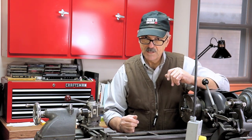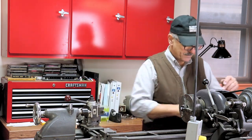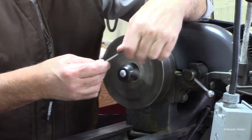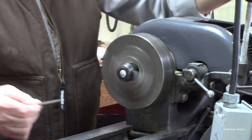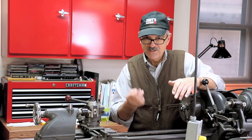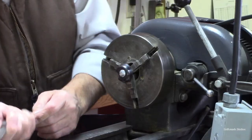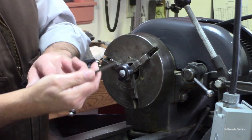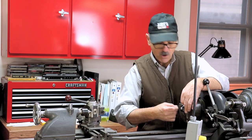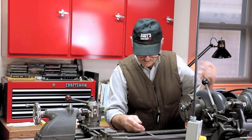There's a bunch of little pitting in it, so I'll use a small file to take that pitting out, then go over it with sandpaper and get it polished up to match the same level of polish as the rest of the gun. One caution when doing this on a lathe: you don't want a death grip on the file, because if the file is in your palm and it catches, it's going to drive itself into your palm. I always hold it very lightly and at an angle so that if it catches, it won't cut into me.